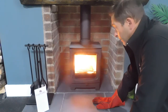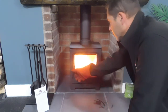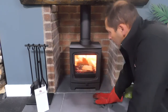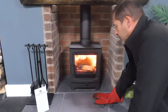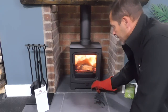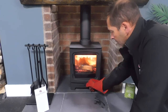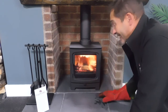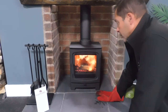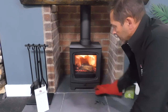We've had the door open for about 20 minutes now and the firebox is fully warmed up, so I'm going to shut the door. We get a slight wobble with our stoves here because of the length of the chimney and the draw in our area — this can be adjusted easily by slightly moving the control to the middle. The reason for the whistling is excess air moving through the valve; by moving it over, as soon as the warbling goes, we know we're letting the correct amount of oxygenated air into the box to make it work without over-burning.